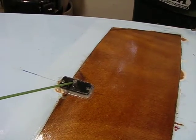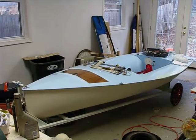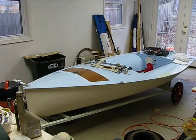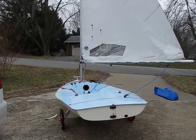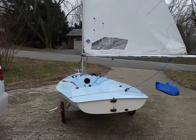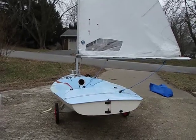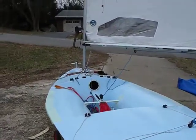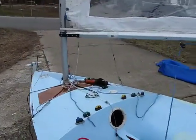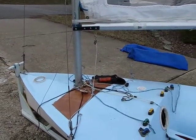Time to put the rig up and see if the geometry still works out. Well, the rig went up. I need to make some modifications — probably shorten the shrouds, maybe make new ones, and move the blocks on the boom and the mast up, needs to be made a little more raked. The mast isn't sitting perfectly on it right now, but all in all I think we can make it work.